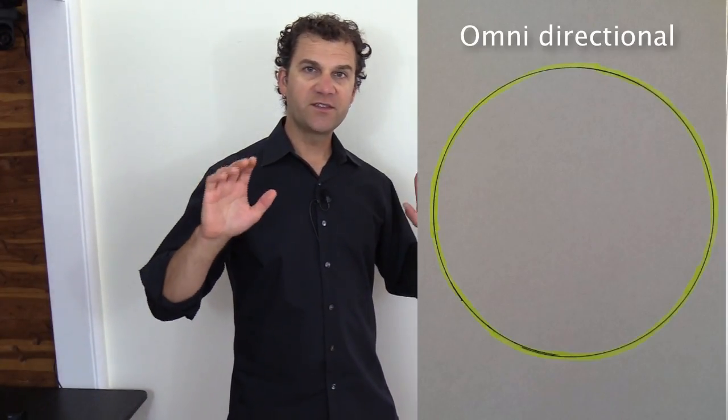The next symbol is a circle — that is omnidirectional. What that means is wherever I am around the microphone, it's going to pick me up equally. Let's switch over to that. Wherever I move with this microphone, I should sound reasonably about the same. As I come around the front, addressing the front, then the side, and continuing all the way around, I'm going to be about the same volume no matter where I am, so long as I maintain my distance. Omnidirectional — all the way around.